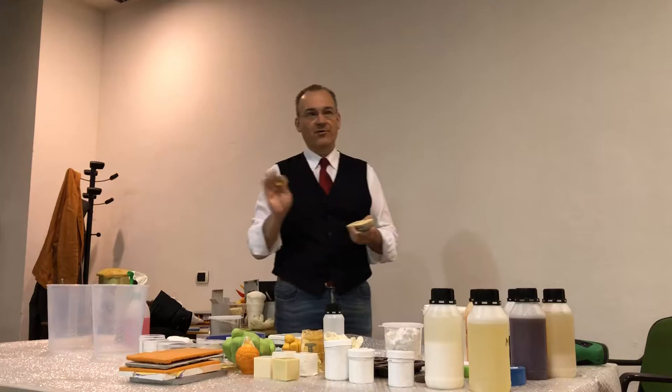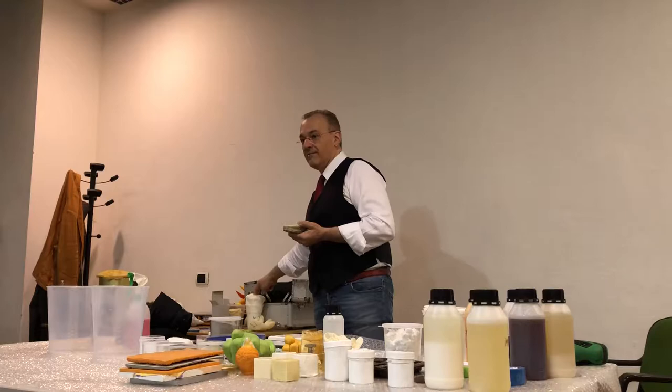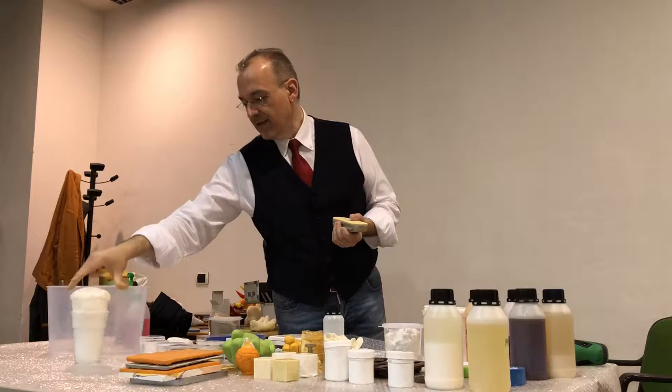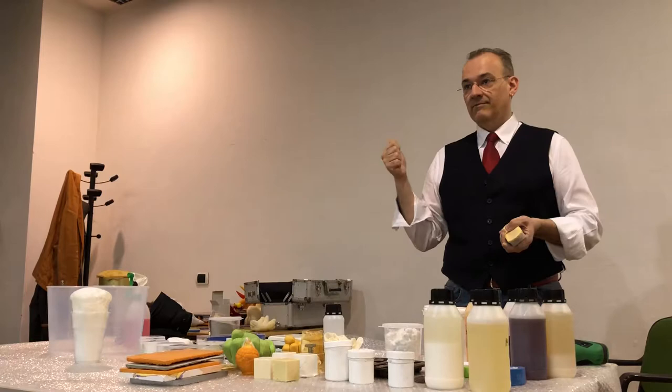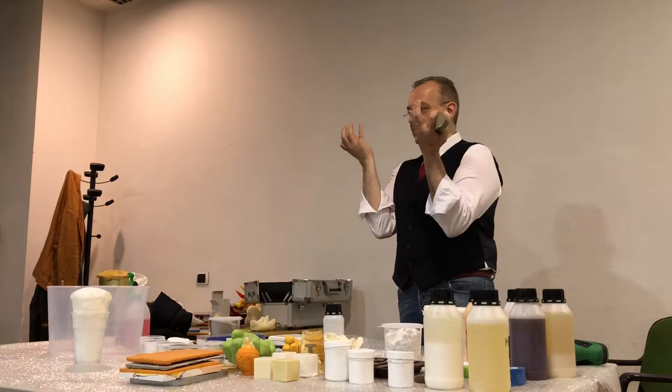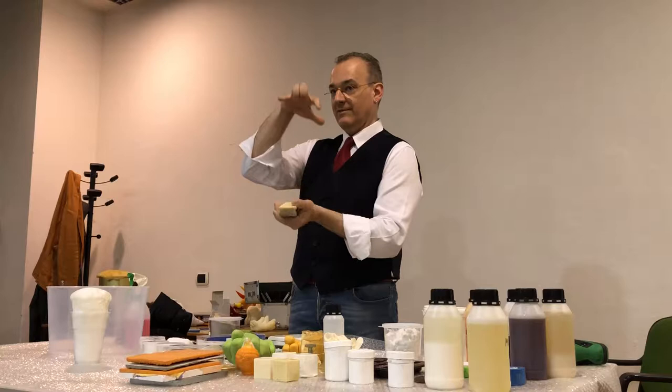Especially, you will probably work, as your teacher said, with expanded materials, like those ones. This is a polyurethane, classical polyurethane. With expanded materials, you must think that there are a lot of other things involved in using them. Pressure. Something becomes bigger because something inflates it, air or chemicals, not important. It makes some kind of pressure. So if you use this kind of material in a closed mold, it will explode.